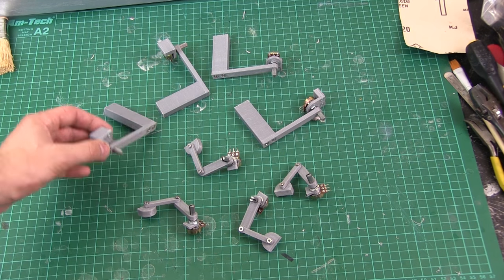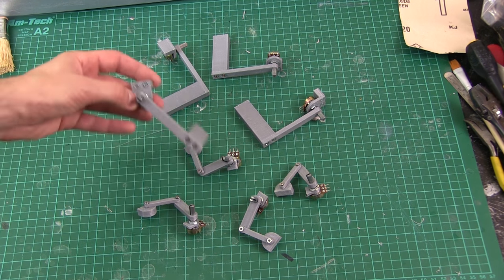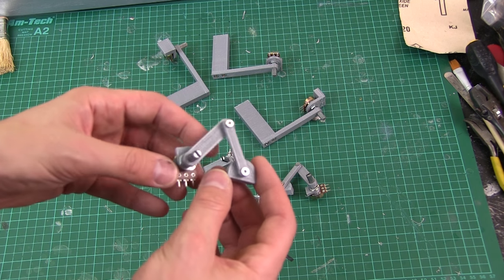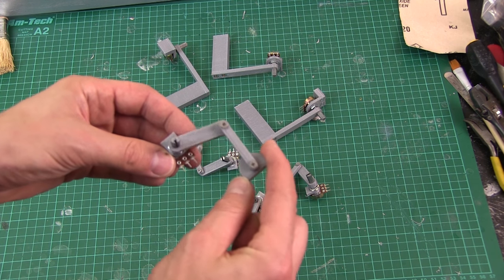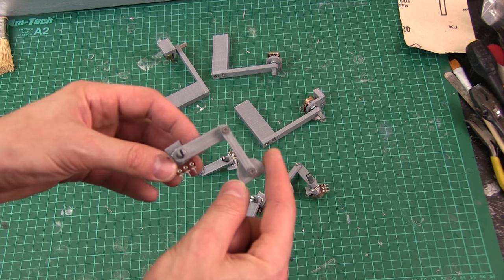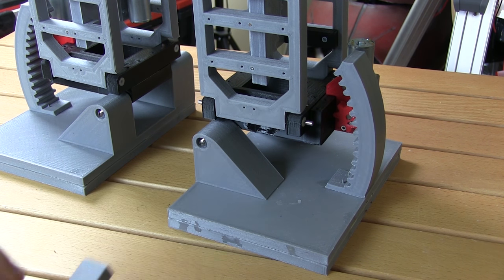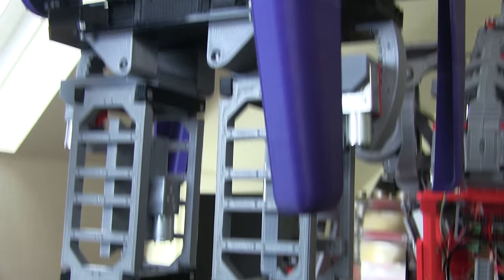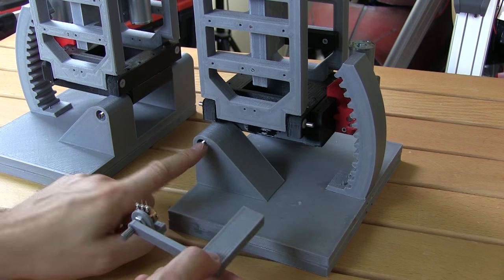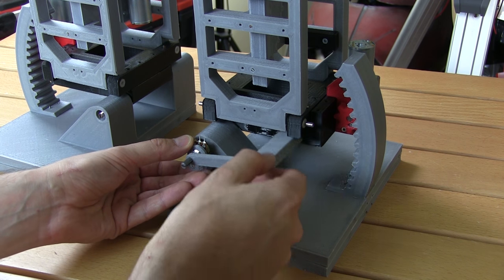I need feedback on all the joints, so I've made these pot holders. Some are as simple as a thing that holds the pot and a lever that goes onto the other part that moves, so I can get this in line with the shaft. For the main motors that move the legs forwards and backwards, we need something a bit more complicated that goes across the corner on the inside of the leg, so as the leg moves it moves the pot around. These ones go on the main side-to-side tilt axis, and we have another two up at the top for the hips. The pot shaft simply goes in line with the axis, and this piece will solvent weld on the inside on the moving part — so as the ankle tilts side-to-side, it moves the pot and I get the feedback.